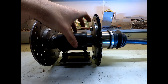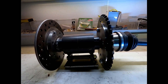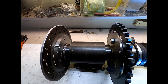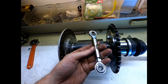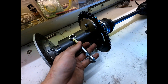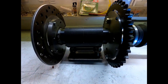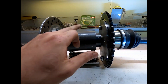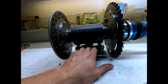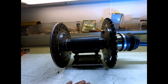What that'll do is allow it all to pivot on that pin right there and that half-inch bolt, giving us chain tension forward and backwards. You pull it back, tighten that nut up, and you've got your chain tension. Up here there will be another tab where this turnbuckle is mounted, and the back side will be mounted to the chassis itself, so you've got three points of contact holding your tension - one, two, three.